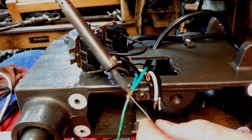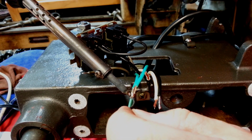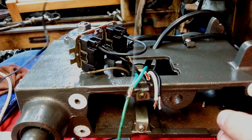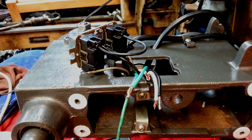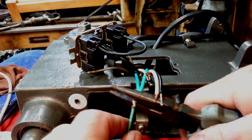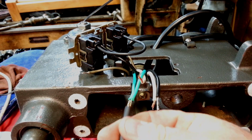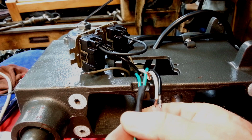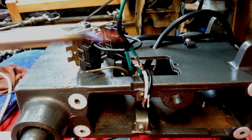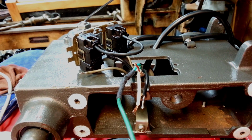Soldering terribly. Okay, let's get back in here. A little bit of solder to make a thermal connection, and then melt the rest of it on the copper. There we go. Now I'm not crushing this with the plier. What I am doing is, like little sharp spots, I'm just kind of numbing them over. Want to make sure nothing punctures the heat shrink. That's quality work, folks.